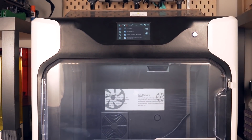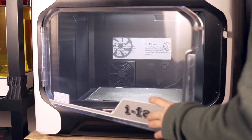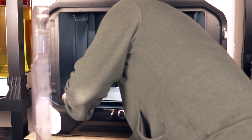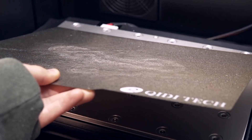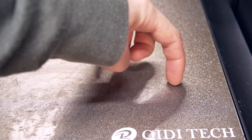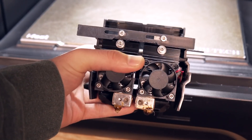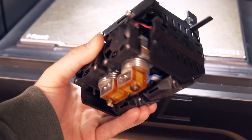As far as printing goes, I'm going to be using the iFAST from Qiditech, which is a monster machine. Don't worry — you don't need anything nearly as big or as crazy as this printer, as the requirements to print with this material are really on par with standard ASA. For the bed, you'll want a heated bed that can reach about 100°C, which most common printers can do. For the build surface, I'm using powder-coated PEI, but regular smooth PEI, BuildTak, glass with ABS slurry, or glass with hairspray will also work for adhesion.